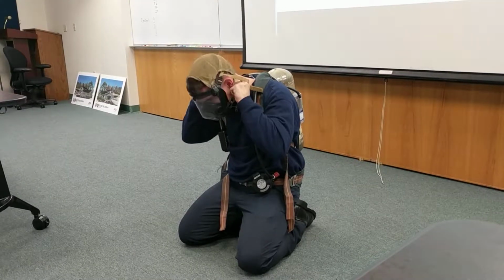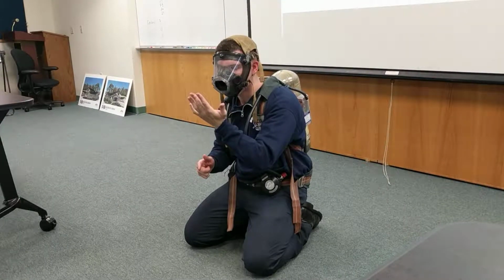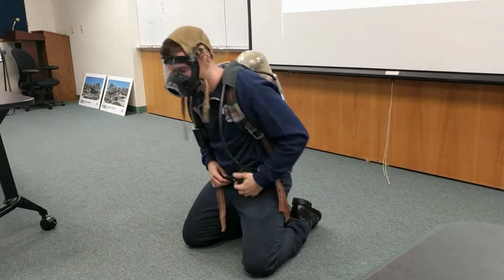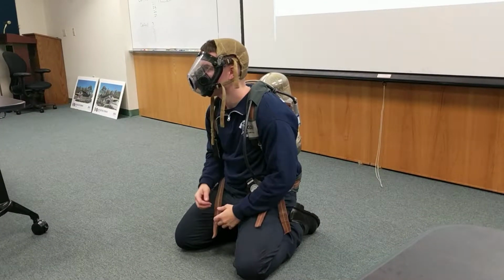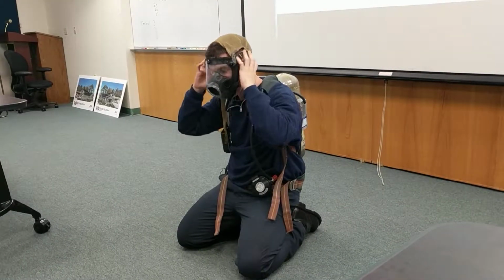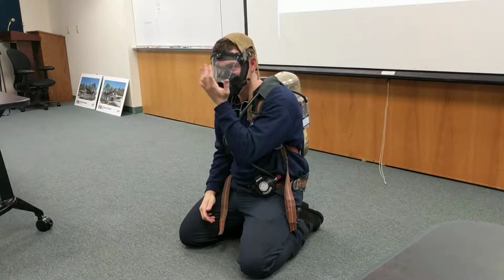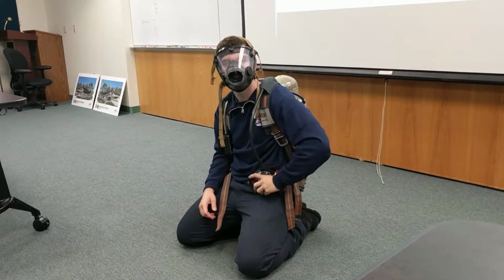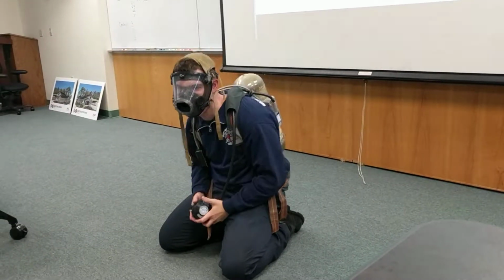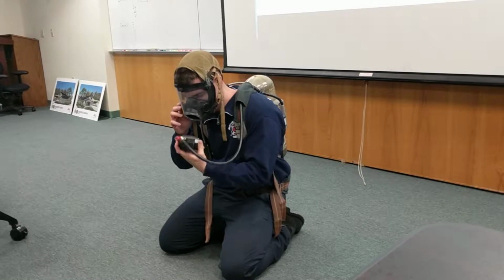Then you want to put on your mask. Hopefully you tightened it before, but you want to use the palm of your hand, put it up to the mask, and once you don't feel any air coming out from the sides, you're going to say seal. So do you create a vacuum or do you blow? No, you suck in. Okay. So you want to make sure it's all tight. This one though only has 4 straps. Your mask will have a strap at the top. So for me right now, it's not getting that great of a seal, but it's good enough. But you say seal anyway, just like if the gauges don't match, you just say match. Hopefully it's sealed enough, because if you're in a toxic environment, you don't want that going into your mask.